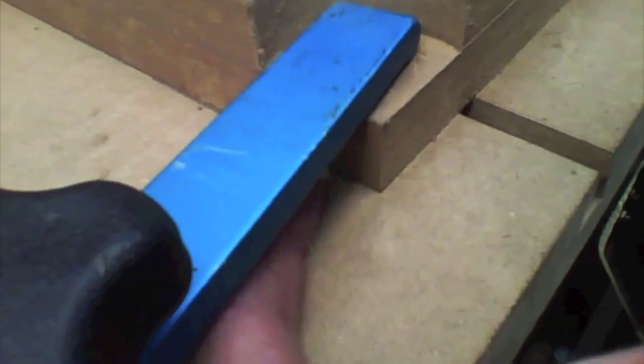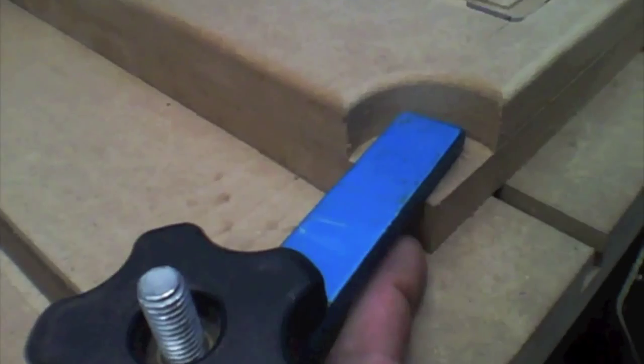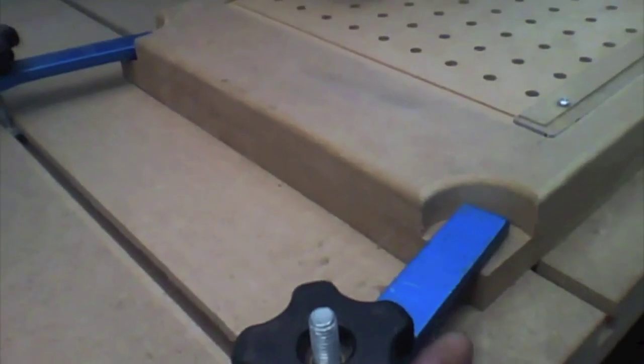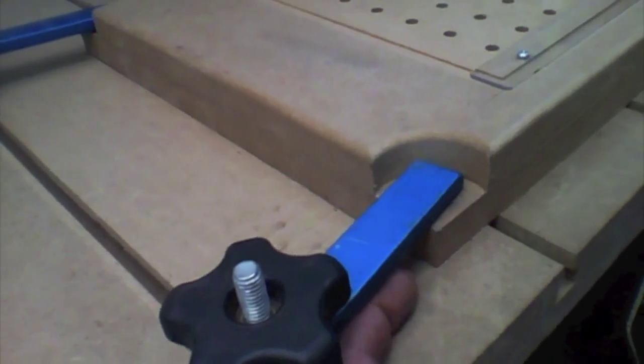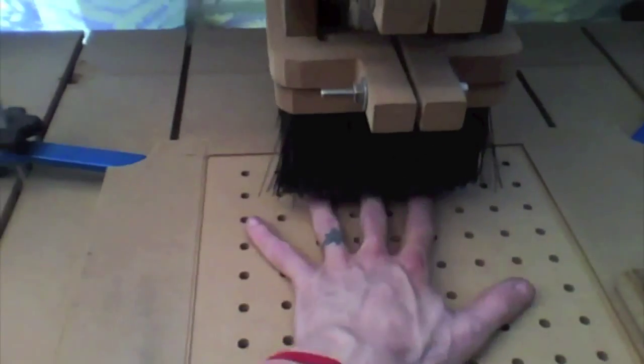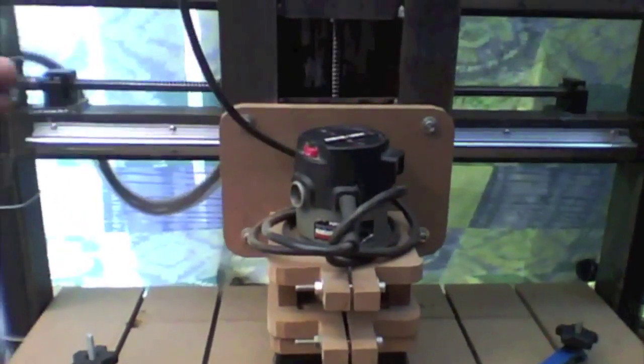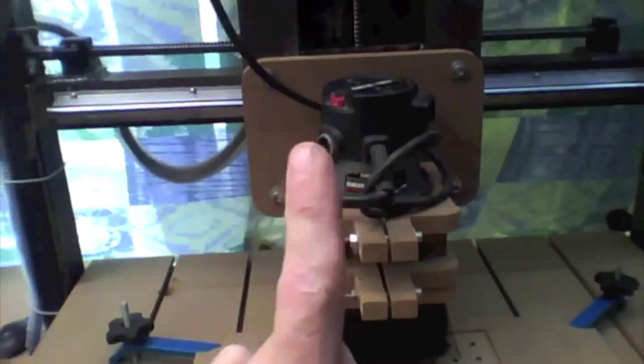And I also have this vacuum table set right up to the lip. This is the lip from planing the table, and it's the extent of the travel of the machine. That's as far as the bit will go. Well, there's a little tiny lip here which allowed me to get this vacuum table up against that lip. And that lip, since it was milled by the machine, is perfectly parallel with the travel of the machine. That's incredibly important.